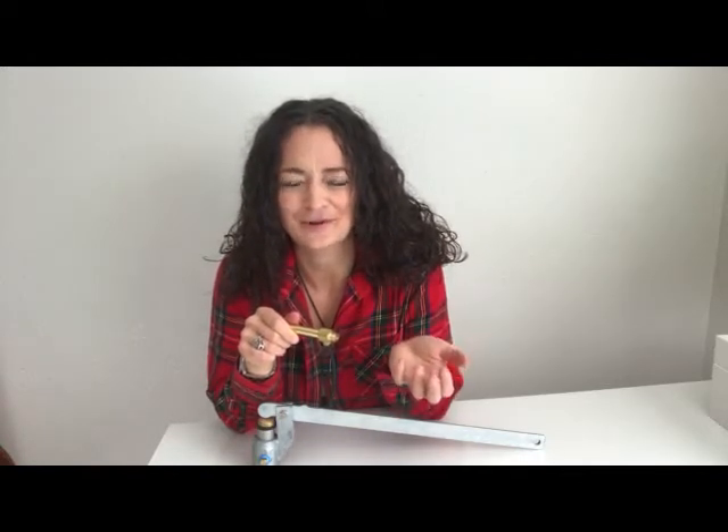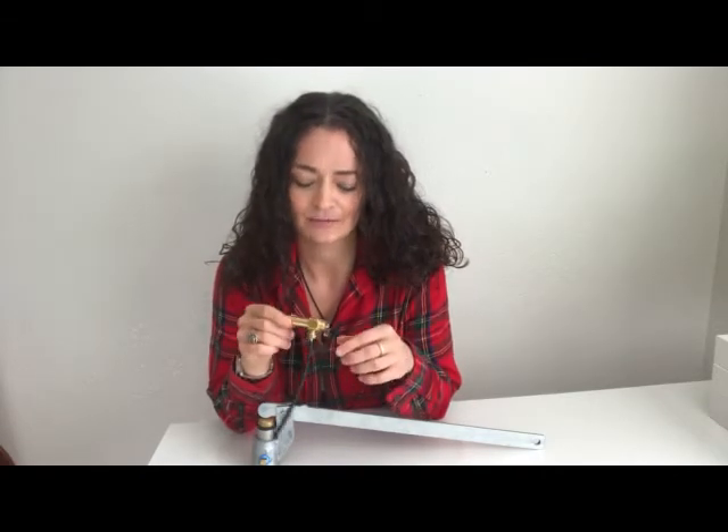Of course we always recommend Best Float Valves, but we're happy to serve you no matter what kind of valve you're using. The micro sweeper, when the water temperature gets below 41 degrees, will start intermittently releasing bursts of warm water into the tank until the water level gets up to 42, and it will help prevent surface ice in your tank.